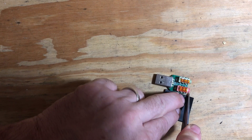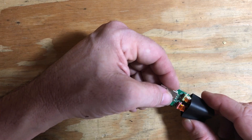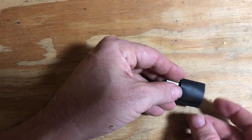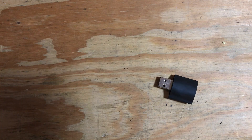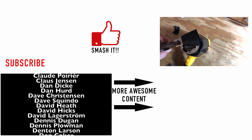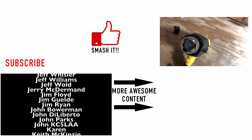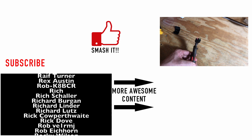To give it a little extra protection, what I did was take a piece of heat shrink — I cut that down, slip it around the sound card, and then go ahead and heat shrink that. Be careful with the heat; you don't want to overheat the card, so maybe use a lower temperature setting.